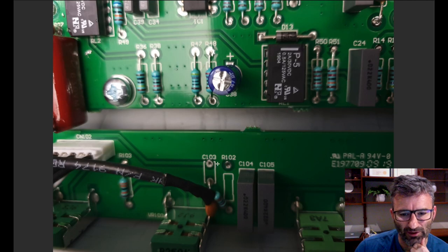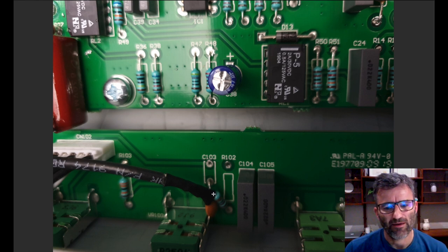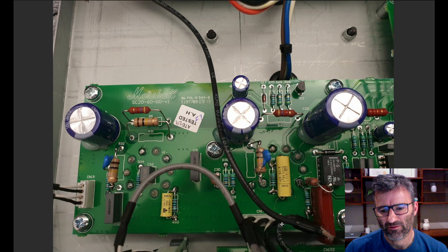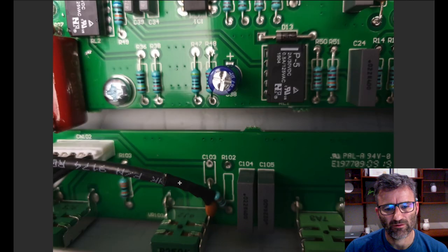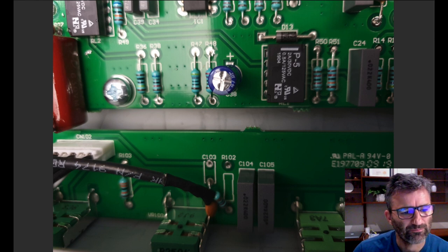So this pulls those out, and then solder them together, and just neatly solder the coax, which is this coax line here. Right, and heat shrink it on there, and we're all happy.